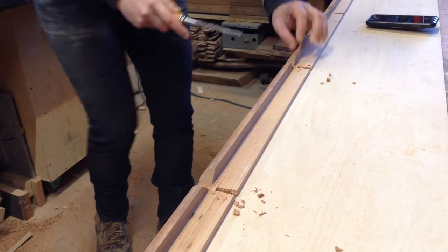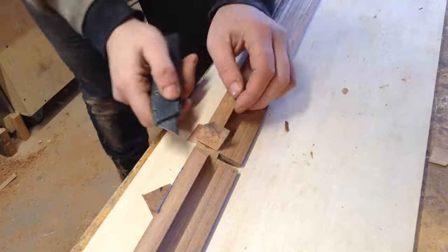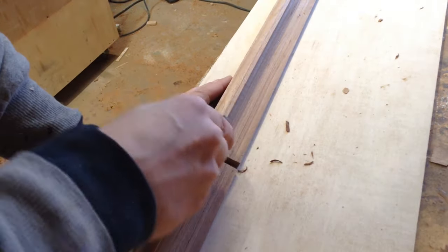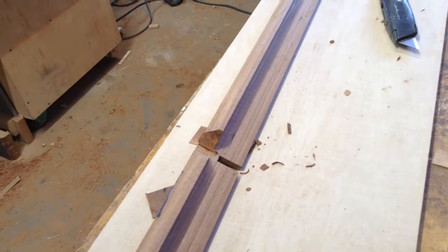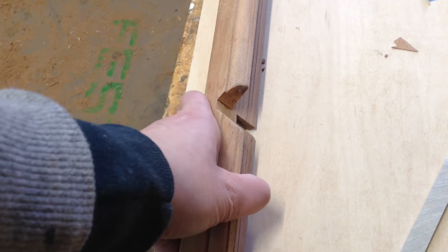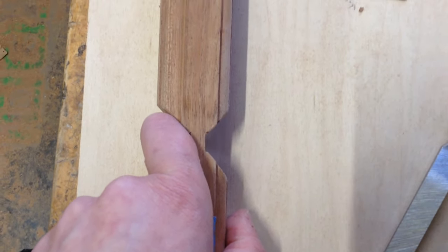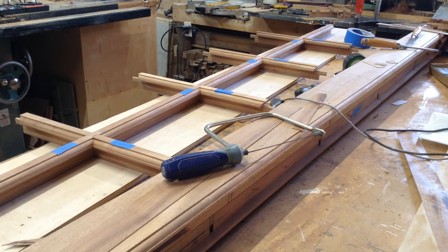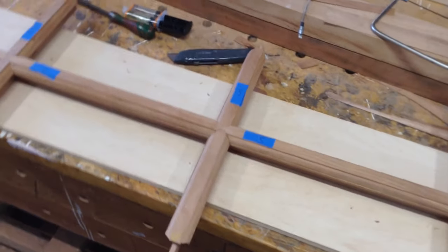I sharpened my chisels for this job so the work was pretty fast. The first joint lined up pretty perfectly. On a couple of the others I had hairline gaps — we're talking maybe 1/32 of an inch. I took little bits of scrap material left over from milling, epoxied them into the corners, then profiled them to the original profile of the material. Once in place you can barely tell there's a small shim there. After finish was applied you can barely see them at all. The mistakes were small enough that those little pieces of material fixed everything.